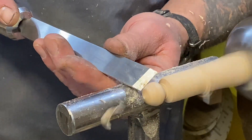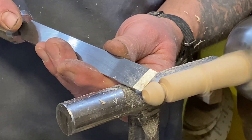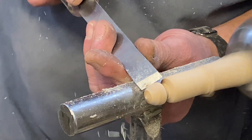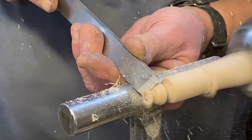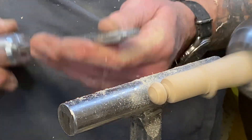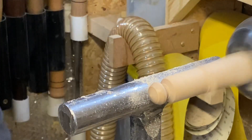So of course, as soon as you come here — see — it's going to kick back. And that's if you're coming in this way. The only way you can do it is if you can get on top and ride that bevel around it. If you can get the bevel to ride around, it'll be alright — it's fine on slopes. But for really small balls like that, it's not really a good idea to do it with a skew.